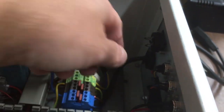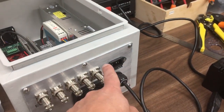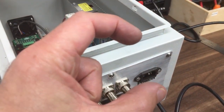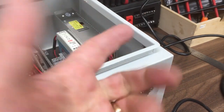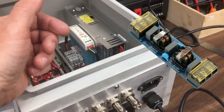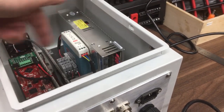I haven't connected the main power input yet because I've ordered a filter unit that will go on the wall just here — I'll make a little custom bracket for it. In the last video I was getting quite a lot of interference from the inverter on the lathe. Because this was plugged in next to it, all the electrical noise was going back out through the cable into the power supplies and making its way onto the display, which was jumping around all over the place. You can buy filters built into IEC connectors, or little standalone metal box types — I've used one on my drill press. But I wanted to go the best I could on this, so I've got what's apparently a hi-fi grade unit. It should essentially be a low-pass filter to stop the high-frequency noise from the inverter getting through to the electronics.